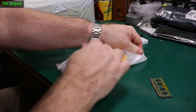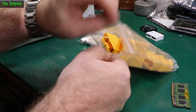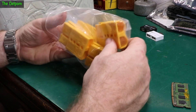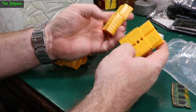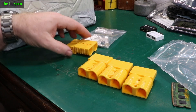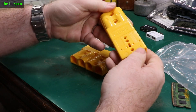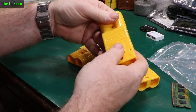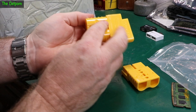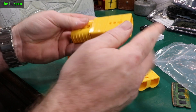Next thing: Anderson connectors. I've actually never used Anderson connectors before, but I've seen them and plugged them in and stuff like that. So these are basically identical — they're mirror image connectors. What you can do is just pair them and they will push together. Doesn't matter which one you use, they will all fit. You've got negative on the same side because they flip over — because they flip that way, you've always got negative on the same side. It's got a polarity to it.